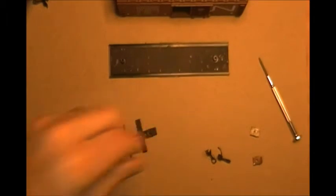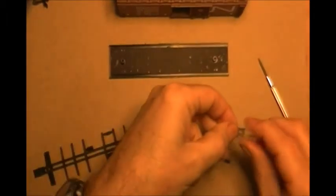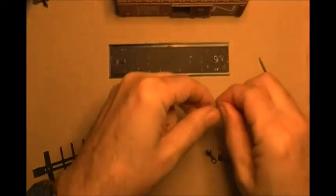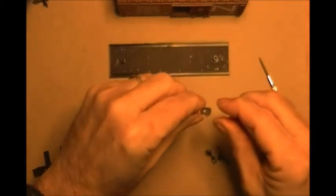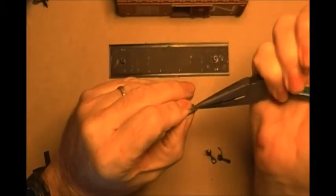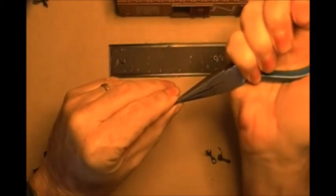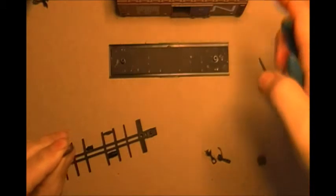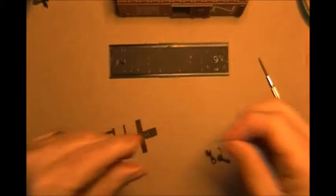Then we can grab our whisker style couplers. One thing too — if the look of these bothers you, if you think they're just a little bit too beat up, you can always sand them and paint them. The big thing is that the inside of these is just a little bit clean. If they've got a lot of rust on there, it's going to catch. So I'm going to put this in the pliers and give it just a slight little bowing — nothing big, just enough to bring it up — so that there's no wobble in the coupler.